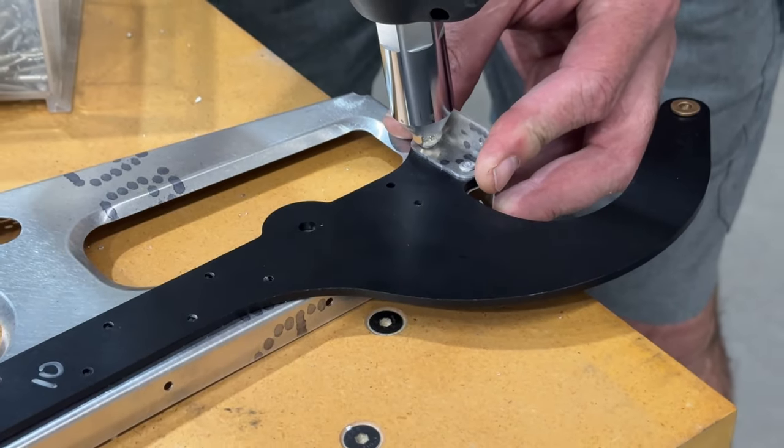The truss is in the left wing — that is complete. I've got my plates mounted. I fit the aileron bell crank assembly in place with drilled head AN4s on the ends. I still need to drill a small hole in the rib and add safety wire. The bolts are Loctited, but as an additional bit of security they want you to do a safety wire there. I still need to put an AN3 in here — that's the anti-torque part of the structure.